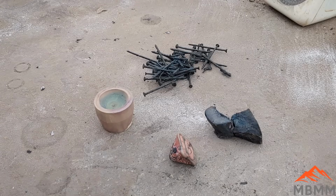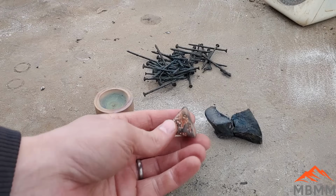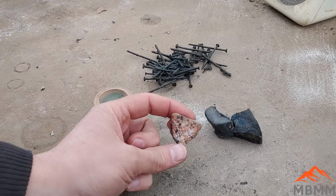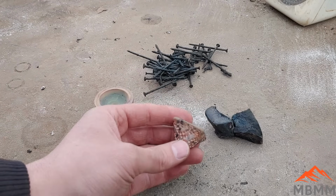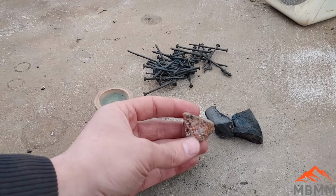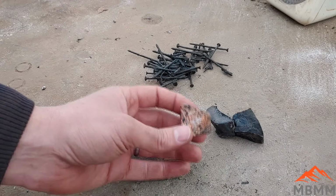All right, guys, lots to cover here. So, to review, this is the one where we were trying to reduce the base metals after we had sulfidized everything. And we got our copper block here, and it weighs just under 100 grams, about 93 grams. So we're missing about 55 grams of material that we recovered when we did our first smelt with just a little bit of sulfur, over here, this block.